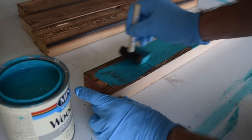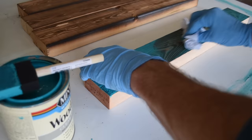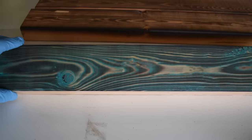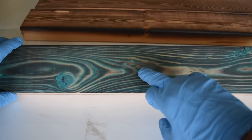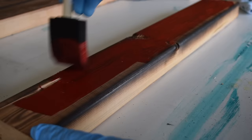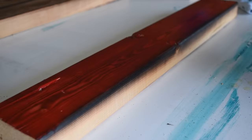Just brush it on, get a good even coat, and let it penetrate down into the wood grain. Then immediately come back with a clean cloth and rub it off. And there you go — it's that simple. If you want it darker, you can leave the stain on a little longer. I like the contrast of getting the color plus the charred wood and then the natural wood that's left behind. We'll try the red next. Same thing — give it a good brushing, make sure it gets all down into the grain. It doesn't have to be perfect. Once you've got it on there, let it set for a second, then come back and rub it off.